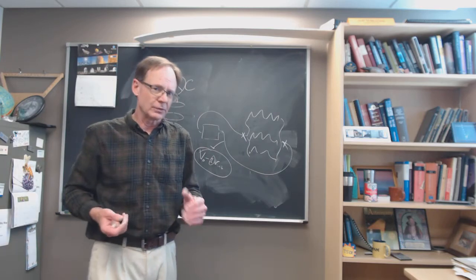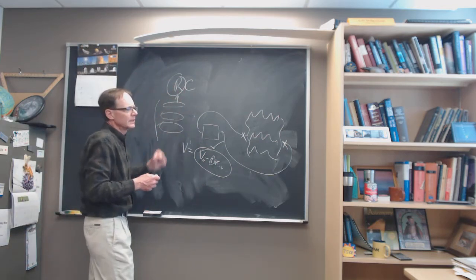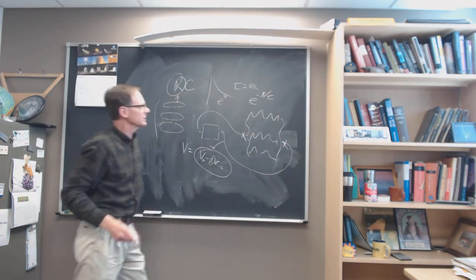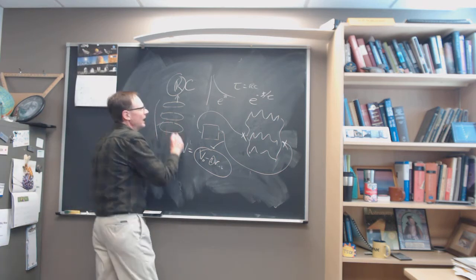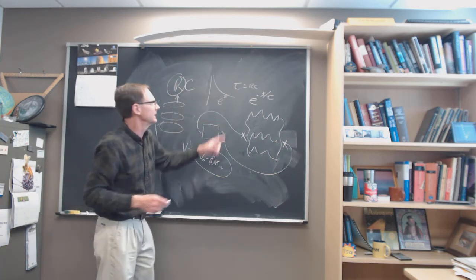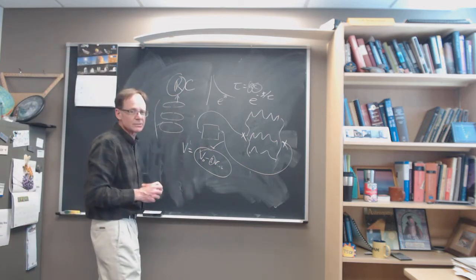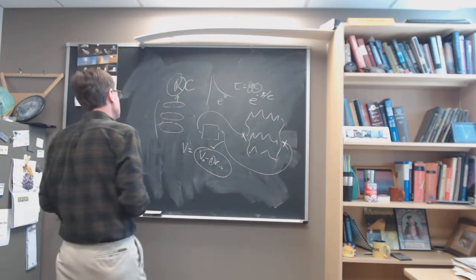Once you have those R values and their uncertainties, you can use them as you charge or discharge a capacitor. You have a large capacitor and an average-size capacitor on the board. You will charge and discharge the capacitor and measure the e-folding time — measure tau equal to RC from the expression e to the minus t over tau. We'll use each of the three resistors in turn to determine the time constant, then calculate C from that. We'll use those three C values to determine our best estimate of capacitance and its uncertainty, and check if it matches what's printed on the capacitor.